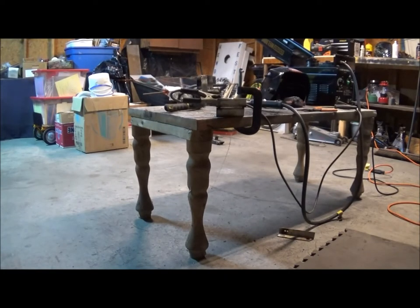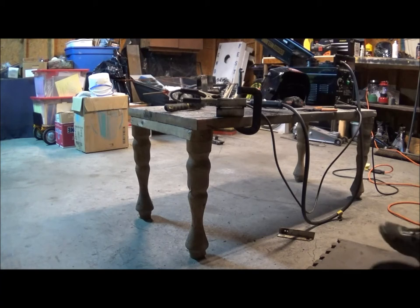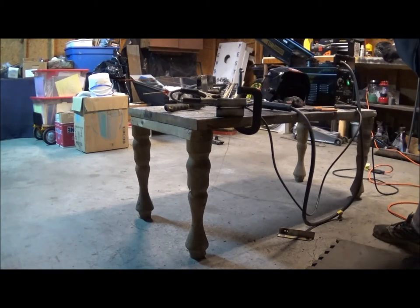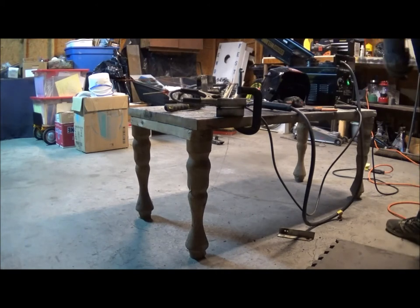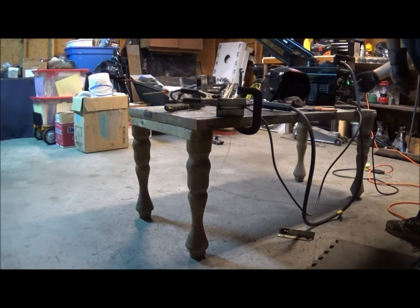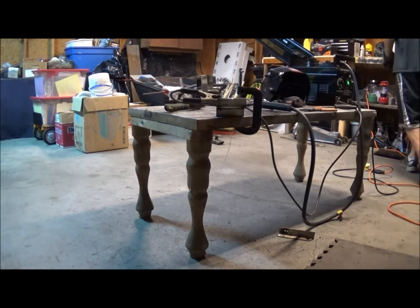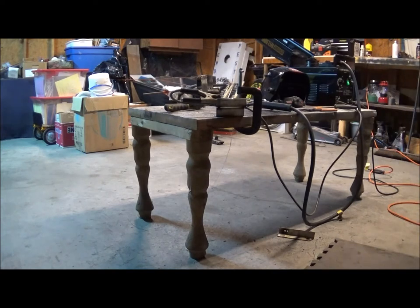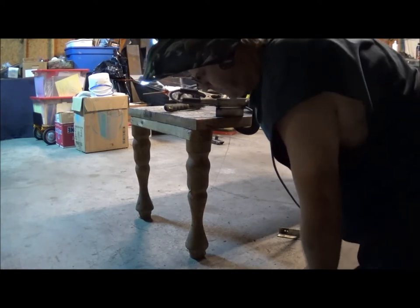I still don't know what this thing's going to look like until I actually get to editing, but we're going to go ahead and attempt this to see what it's going to look like, because I don't even know for certain if you can do a decent horizontal butt weld with a flux core welder. This is a bit thicker stuff — I think it's sixteenth or something. I'm going to turn it on high, run it on about six, get the welding hood, and make sure we're rolling.